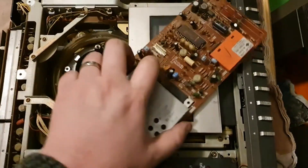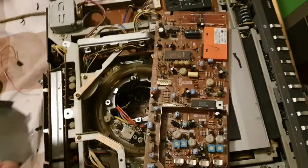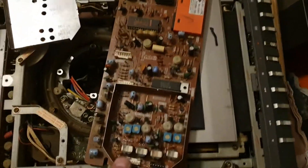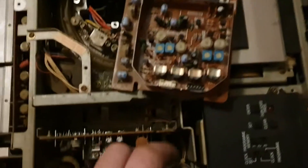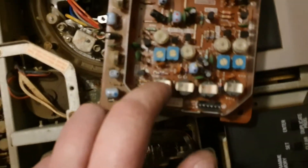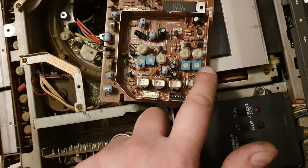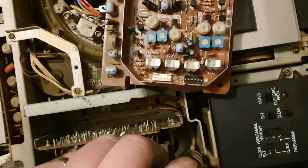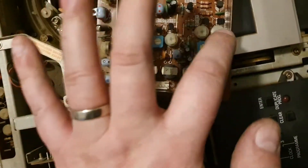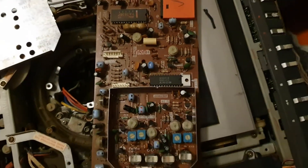The head itself plugs in here, and inside it's quite interesting — you have obviously two cables for the heads, so one set in there and a set in there. Then you've got these four, which I assume are almost like amplification transformers — little trans-amplification transformers. Then you've got four pots there for head balancing I guess — I'm not going to touch them as they were sorted at the factory. Then there are one, two, three, four further potentiometers, and two multi-connectors which connect it to the rest of the machine.